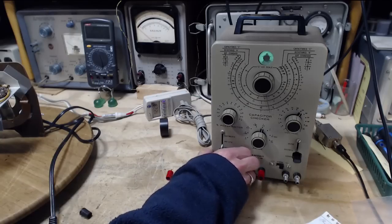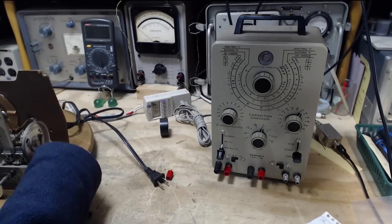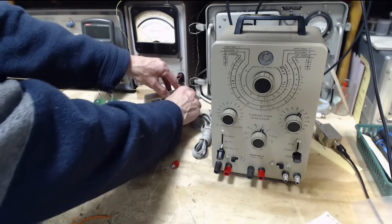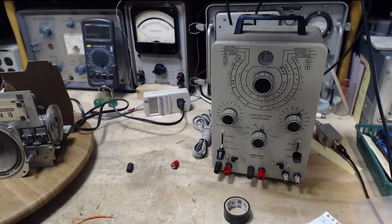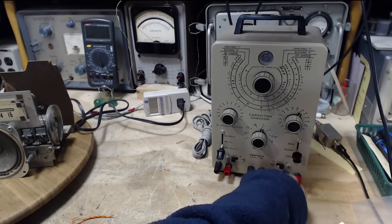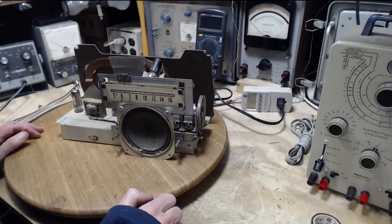Okay, so next we play the radio. Now I still have the permanent always-on short in place. Okay, my friendly little radio, you should be feeling a little better now. Especially, I think the one capacitor is really of significance. The other three probably not going to make much difference. Radio was already working. So another issue here is alignment. I've changed some components. Shouldn't really have affected the alignment, but who's to say?